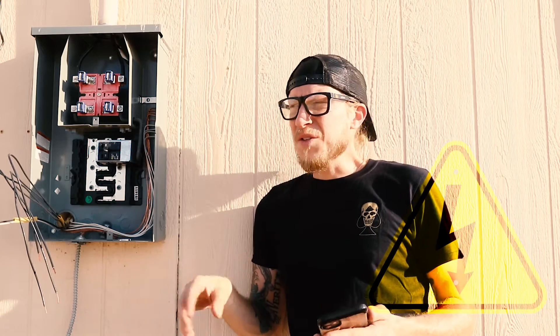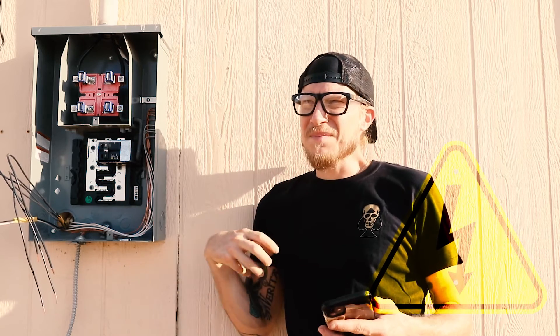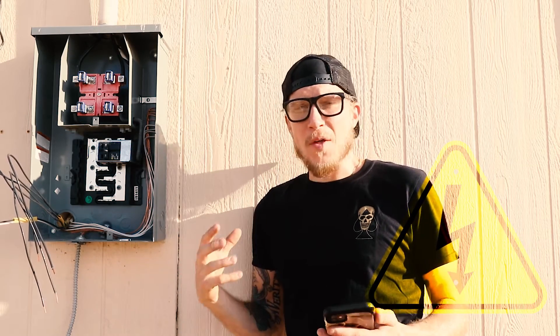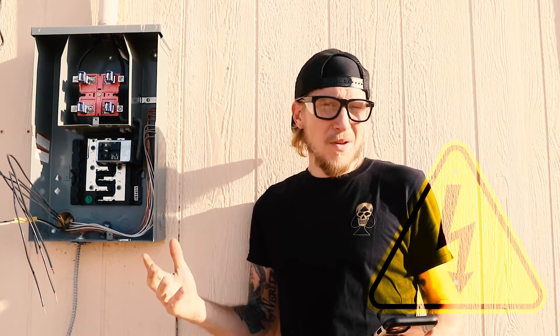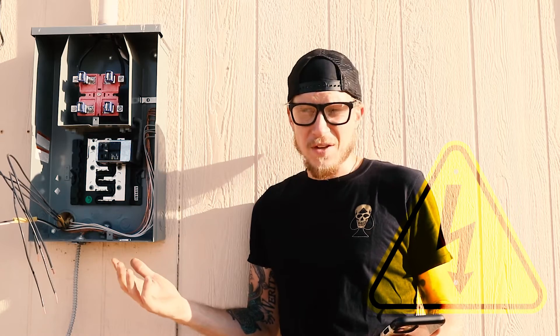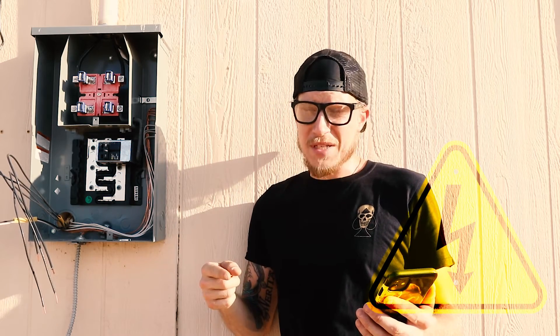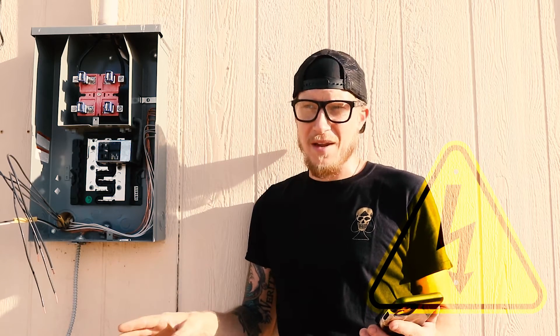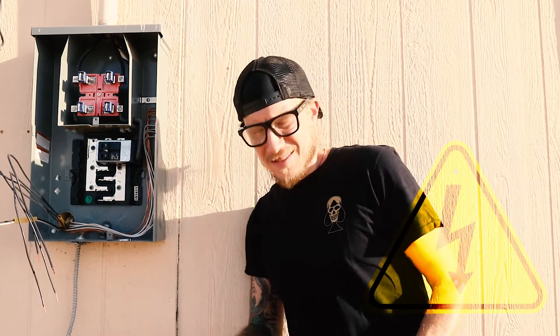The reason they want you to absolutely get a certified electrician to install these is that typically these are done as backup generators for an on-the-grid home. If you try to set it up yourself while being on the grid, you not only run the risk of electrifying yourself and having a real bad day, but also back-feeding the grid power, potentially causing a really bad day for any of the line workers servicing your area. Don't be a dingus. Be safe.